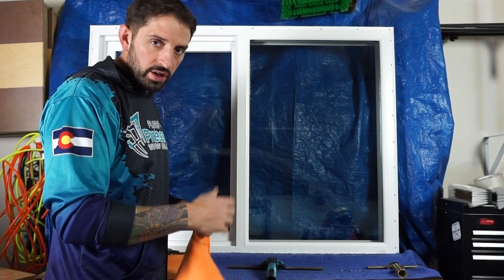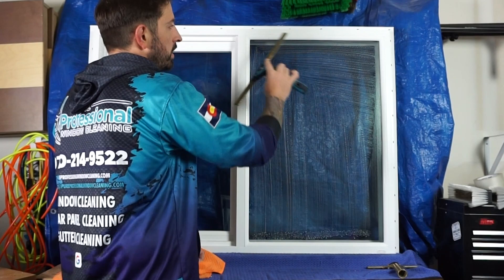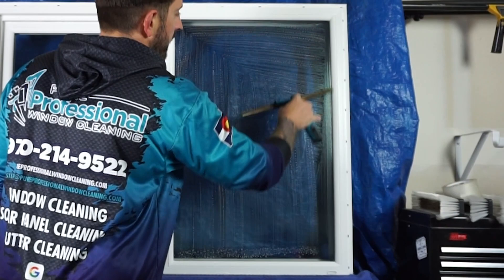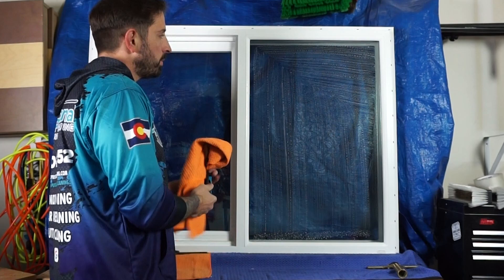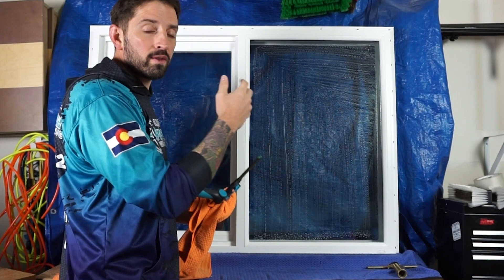So for two pulls, the technique I would suggest is one of two things. You have a 14-inch squeegee — either take the edge of your rubber here, being real careful not to shove the actual corner of the channel onto the glass. What we're doing is removing solution from the sides, from the top, and from this side for the most part. That way, when you squeegee, there's not a whole lot of detailing and not a whole lot of water at the top driving down the glass and creating streaks.